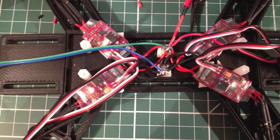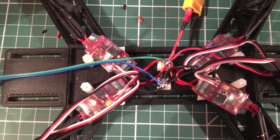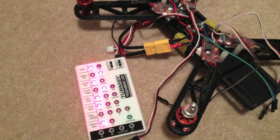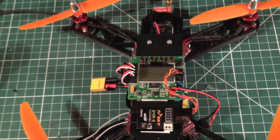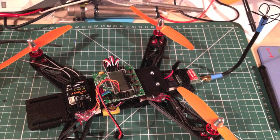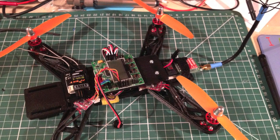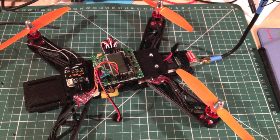Just completing the wiring here — the green and blue wires are going to go to the KK 2.1 board, and the XT60 obviously for the battery. Then I just reprogrammed the ESCs slightly so they're on NiMH style rather than LiPo, so they don't cut off. I'm using an Emotion RC 600mW 5.8GHz transmitter with a lovely skew antenna supplied by Bignose13. I've got the new KK 2.1 board, which has the advantage of not having to solder in anything for the LiPo alarm, and I'm using CPPM again to one of these little FrSky D4R2 receivers.